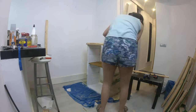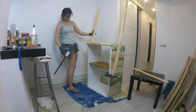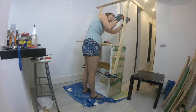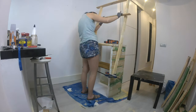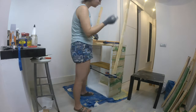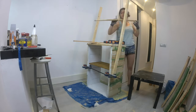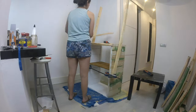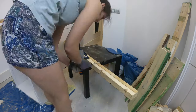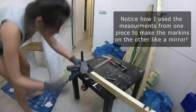Get everything together once more, because now we are going to measure where we want the upper shelving to be. With the help of a clamp, I got the side bar in the position I wanted, and using a level I marked where I wanted the shelves to be. The idea is to make a space where the shelves can rest on, almost like the sides were holding the boards in place. Figure out the angle and make parallel cuts inside the markings — this way you will be able to remove the slimmer slices easily with a screwdriver as shown on the clip.